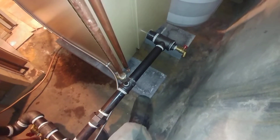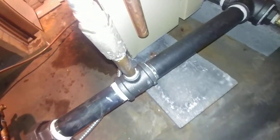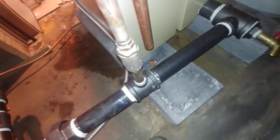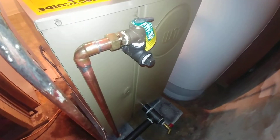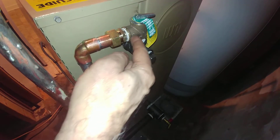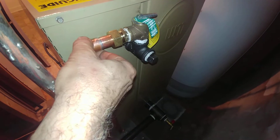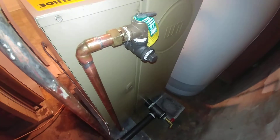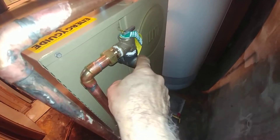And this is where we tie in the feed — that's a brass nipple, a shut-off valve, and then it ties into the copper in the back. There's the pressure relief valve. I've got it on a compression fitting — three-quarter male by seven-eighths compression — so this can be removed easily without bringing a torch back here if you don't have to. And this, again, is for access for cleaning out.